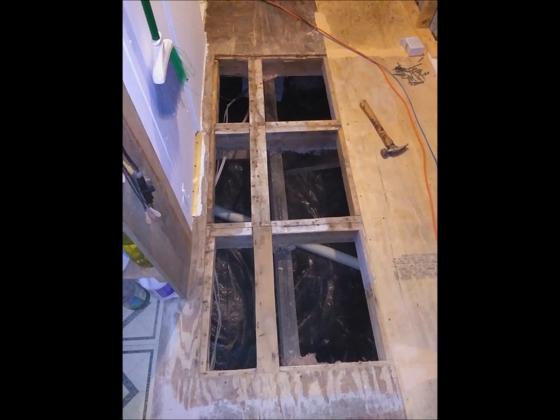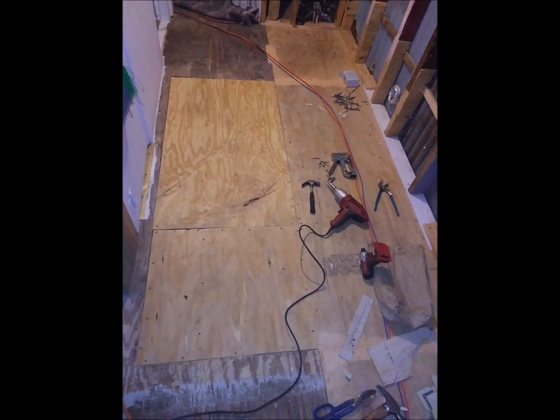Coming up in the next video I will be replacing the flooring in this little hallway walk area. Whoever had replaced the flooring in this area before used too thick a piece of subfloor, so there was a ginormous unevenness in this whole area — there was supposed to be 5/8ths and they used 7/8ths, so there was this hump. I wouldn't have been able to install any kind of vinyl sheet flooring whatsoever with that severe amount of hump. Here is all of the subfloor pieces we installed in this laundry room, all level and even to each other, so that we can install our vinyl sheet flooring later on.